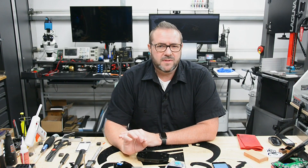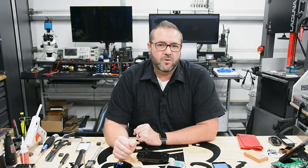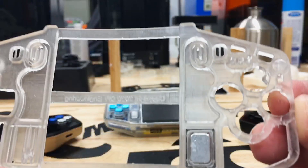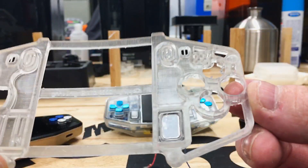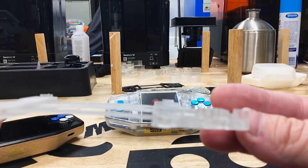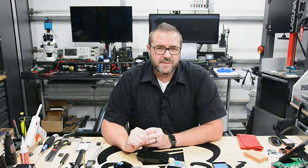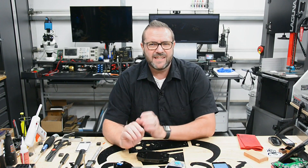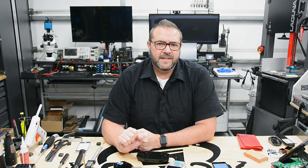This allowed me to remove the 2.5 and 1.8 volt supply circuits, simplifying the board. Lastly, I added display footprints for both vertical and horizontal display orientations. Improving the audio design for better sound, I incorporated dual isolated 2.5 cubic inch speaker enclosures into the sub-assembly. Using an online tool, each enclosure was ported and tuned to around 80 Hz, punching up the low end — although most retro game audio is in the higher frequency, this helped dampen that tinny sound most handhelds have.